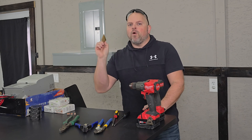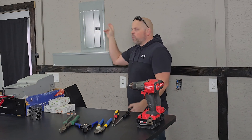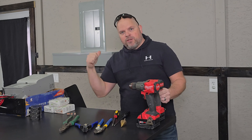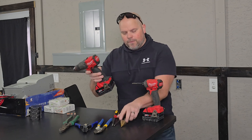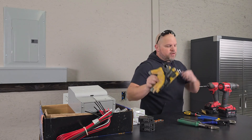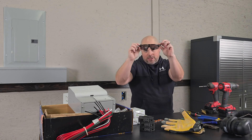You're going to need a step bit for drilling into any metal — if you're going into the box where you have a knockout, you wouldn't need this, but I'm going to need it for my electrical trough. Then I have another four-way and a drill for using the step bit. And don't forget a pair of gloves, ear protection, and eye protection.